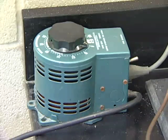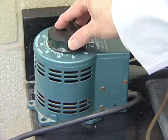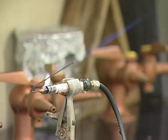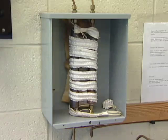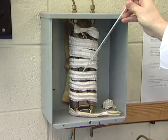After the column, heating tape, and insulation are assembled, connect it to a rheostat and flush with nitrogen for two to three minutes. Adjust the rheostat until the column is warm to the touch. Begin to pass hydrogen or a hydrogen mix at a low flow rate through the column. Make sure the room is well ventilated and combust the hydrogen as it exits with a flame. After the copper inside has been completely reduced, insert a thermometer between the column and the heating tape. Adjust the rheostat slowly to give a temperature of approximately 180 degrees. Once the column is set to the correct temperature, the rheostat will not need to be readjusted as long as no components are changed.